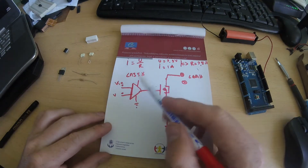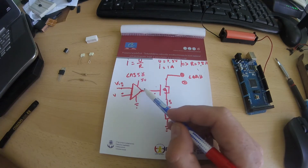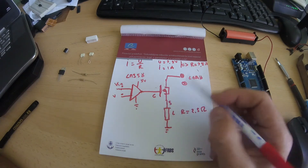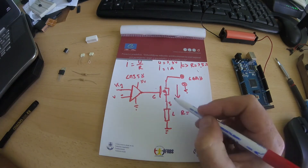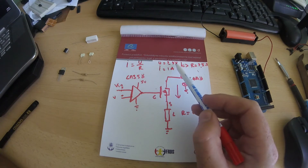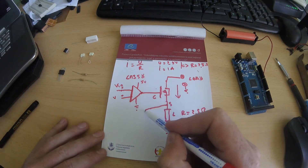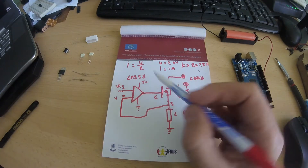So when you apply a voltage to the amplifier's input, the amplifier output goes high, which opens our MOSFET. When the MOSFET opens, current flows from the battery through the MOSFET and to our load. But we want to control this flow to maintain a voltage of about 2.5 volts. To do that, we take the voltage drop on this resistor — the V-ref — and hook it up to the comparator input of the LM358.